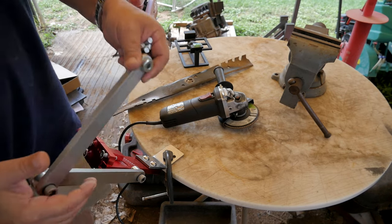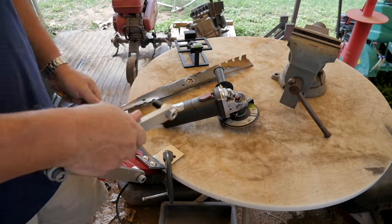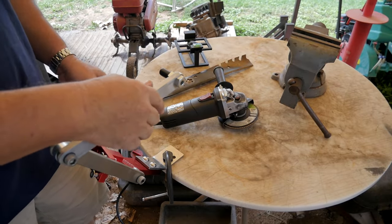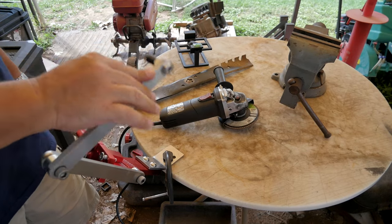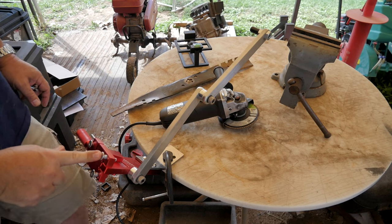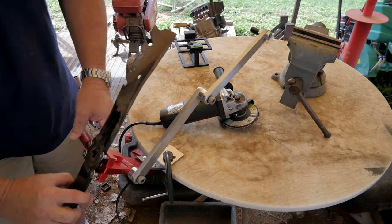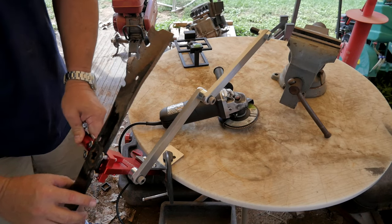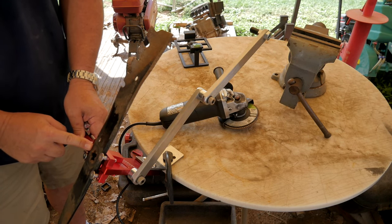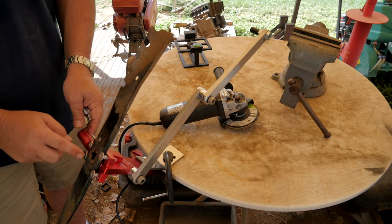A few things to note. You can see the bolts here — you can back them off and adjust them if you want it really loose. When I first got this, it was really tight and it would have been hard to move the angle grinder back and forth. I loosened it up a tiny bit, but I didn't want it just flopping around — that's your preference. These adjustment screws I've screwed in so that when you put your blade in, it's got something to grip on the edge. There are other blades with different shapes, so you might have to adjust these to fit.